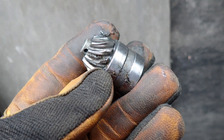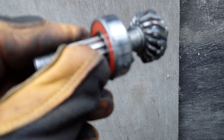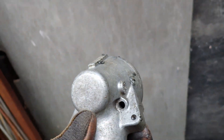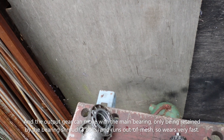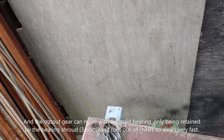These gears are probably serviceable — you can see wear here by my thumb — and the fact that it's lost most of its grease. There's a bit on here. Sometimes if this bearing starts to lose its grease it'll spin in its housing, and if you put a loose bearing in here the grease escapes alongside the sides of the bearing, so that's not worth doing. Putting it in with Loctite or Studlock or bearing lock doesn't work because those compounds decompose with heat, and these tend to get worked hard and get very hot.